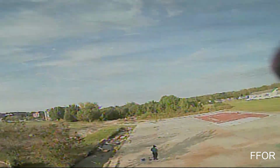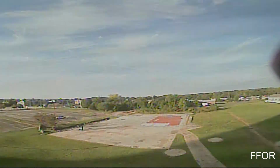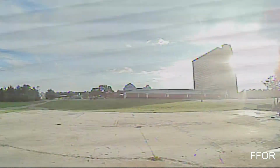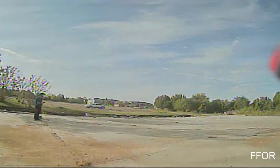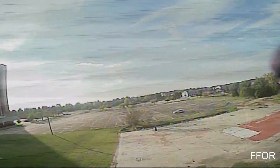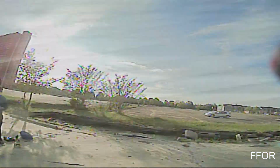With the 2306s, I'm still using the same batteries that I was using, but the awesome part of it is I was getting almost 5 minutes per flight. And that's flying at speeds that were faster than stock, with a lot of on-throttle and off-throttle flying. But the least amount of time I got on my battery was about 3.5 minutes. I was blown away considering that I'm going from a 2205 motor to a 2306, and from 2300 kV to 2700 kV. I was blown away that the batteries came down to still 14.7 to 15.1 volts in 4S, at 3.5 to 5.5 minutes.